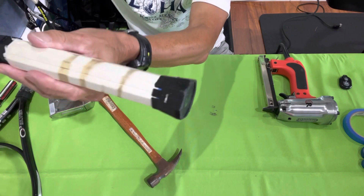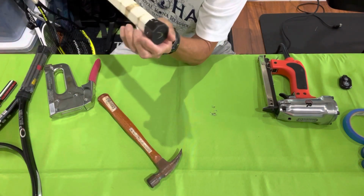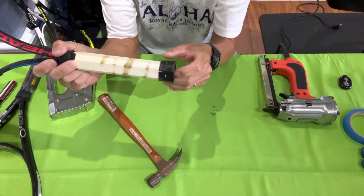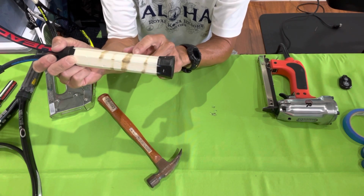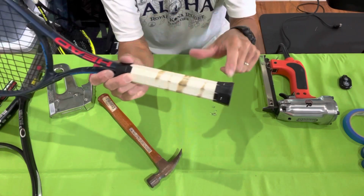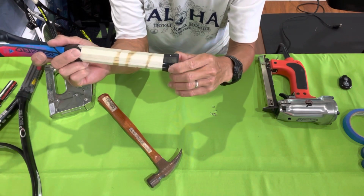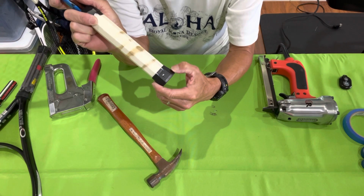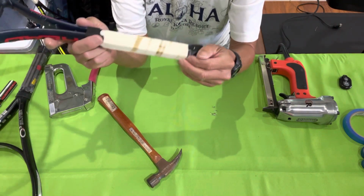You can see that all the staples on each side went in. Now, you're gonna find that sometimes when you're using a manual stapler, it might have a hard time penetrating even the urethane foam, because if it hits the metal part of the frame that's underneath it, then that's when the staple will start to bend and it won't go through. So this one just barely made it. I actually smashed down the staple a little bit. So anyway, that worked out.